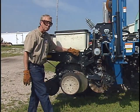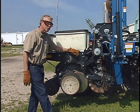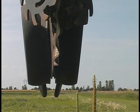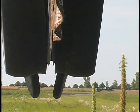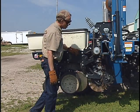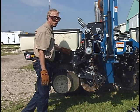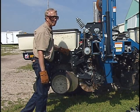As important as anything is the depth of the coulter operation. Research shows you want the bottom edge of the front coulter at the same level as your double-disc seed opener, or perhaps about a half inch above it. You want to fracture the soil, but digging below the seed furrow actually loosens soil and can inhibit moisture reaching the seed and good seed-to-soil contact. So at or slightly above the seed opener depth is ideal. For no-till planter operators, the real issue is what goes up front — leaning toward row cleaners — with proper height adjustment to manage residue right in the seed zone.